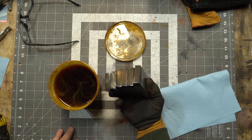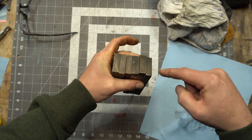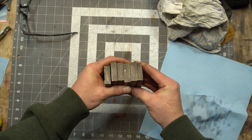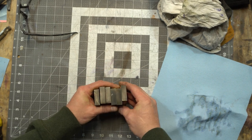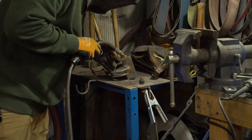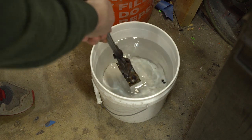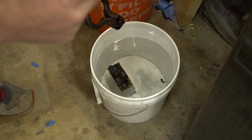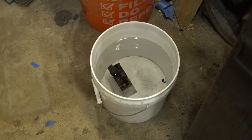Got a lot of little wavy lines in there. I got them all lined up so that they're going the same direction. With this I'll be able to go MIG weld them up and put them back in the kerosene. I actually welded a piece of eighth inch 15n20 between each of those layers — that might make the pattern a little more interesting.